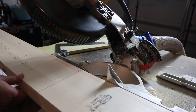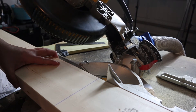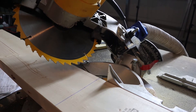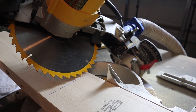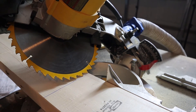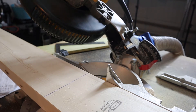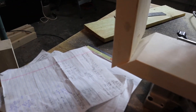For this cut we're going to line it up very manually. Typically you'd say it's in the middle of the slot. I take the cover off and very carefully — no hands on the trigger — pull this down and align it with the blade. You can do this on a regular cut too if you want to make sure it's the right final length. What we're going to do is make sure the inside edge of the blade is on the inside of the line so whenever you cut it goes straight through. That fits perfectly. Now we're going to cut. It'll fit perfectly with another piece like that.